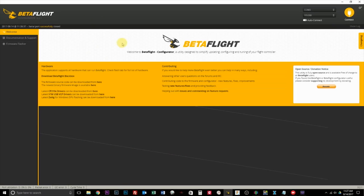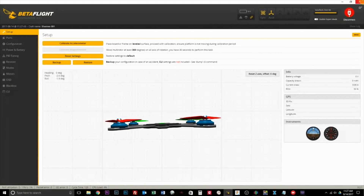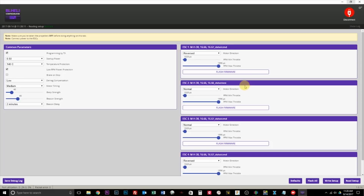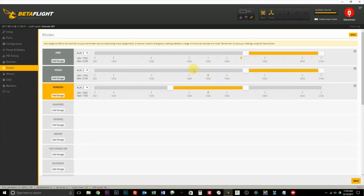First and foremost, you've got your quad, you connect everything up, you've got to have the new Betaflight configurator and be on Betaflight 3.2 at least, one of the release candidates. One thing that gave me a lot of trouble — this is actually pretty simple — but I initially tried to do this while on Multishot. You absolutely have to change to DShot. Make sure you're on a compatible DShot protocol in Betaflight, then go over to BLHeli and make sure your ESCs are flashed with DShot-compatible firmware. I had selected DShot in Betaflight but the BLHeli firmware version I had was not DShot compatible. Make sure you're on DShot in both Betaflight and BLHeli.